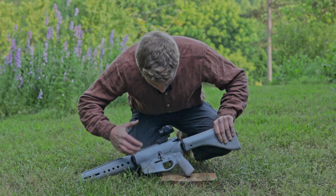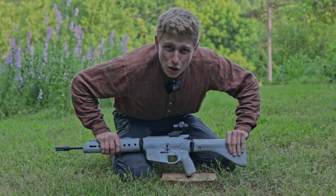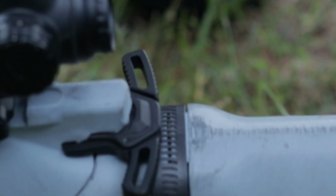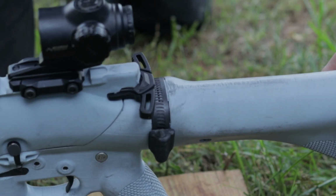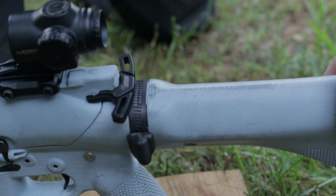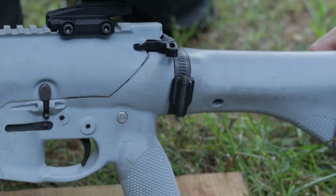Well, there is a crack forming. You can maybe see it on the video when we push down. Let's get closer up and show you guys. Okay, so you're going to be looking right in this area right here, and you'll see there's a crack which opens up when we push on it. And if you look at the buffer tower, there's a significant gap where the PLA and the nylon is stretching. Looking at it, it looks like it's not the nylon clip, it's actually the PLA deforming. I'm not even sure. But something is flexing there, and there's a gap opening up between the buffer tower on the lower and the stock. But when we let go, it closes right up again. It's just elastic deformation. That was not an expected result.